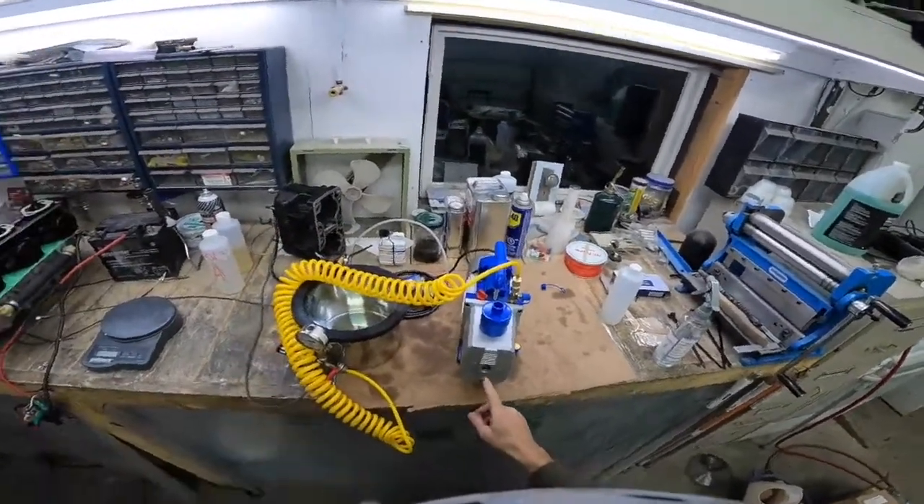It would be a good idea to take it apart and put a little bit of oil in it like I did. The reason I wouldn't recommend putting oil in as you assemble it is because there's a pretty high chance you're going to get dust or debris floating in the air, and if you've got really oily parts it's way more likely that stuff is going to stick to it. I think you're better off to completely assemble the pump, then once you have everything assembled pull those three bolts off from the back side, pour a little bit of oil in, and right away put the cover on. That way you avoid the chance of a bunch of debris getting in there while you're working on it.